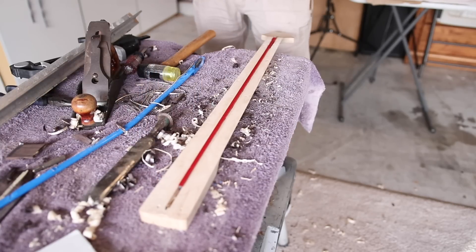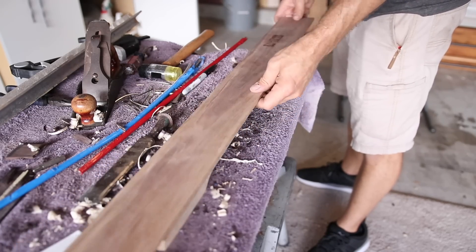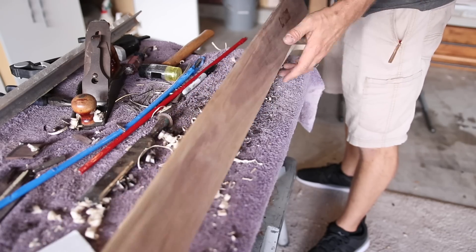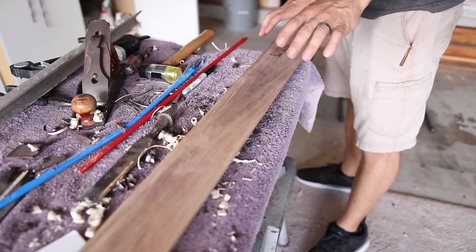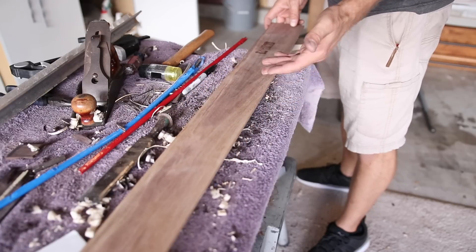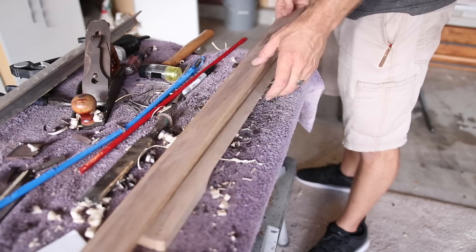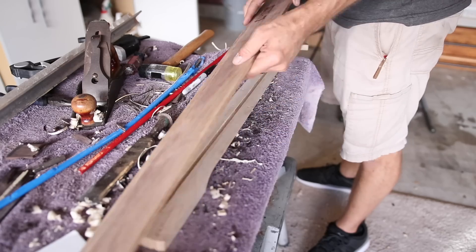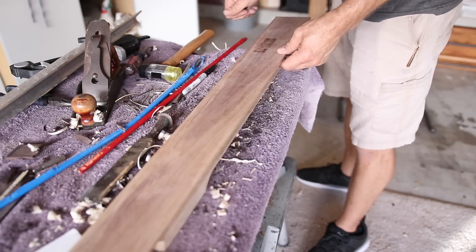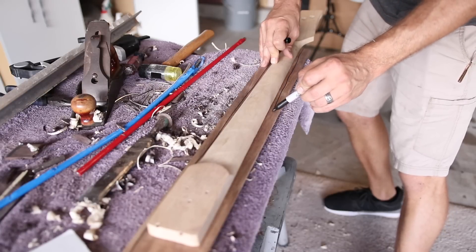That looks like it's going to be a perfect fit, so I think we're good to move forward. I have a three and a half by 36 by quarter inch black walnut craft board that I got from Home Depot. I think I got this for like 10 bucks and it's already really flat and really smooth. If you don't have a bandsaw and you don't have the capability of resawing your own neck blanks, this is a really budget friendly option. In fact, I see people selling these on eBay for like 30 or $40 for a fretboard blank — they're literally just going to Home Depot and picking out the nicest, flattest ones and reselling them for more than twice the price. So I'm just going to trace out a rough outline of the shape and then glue it on.